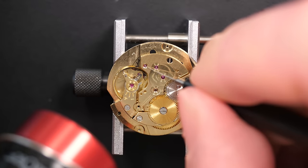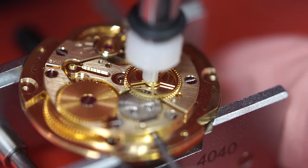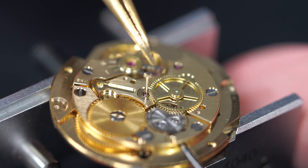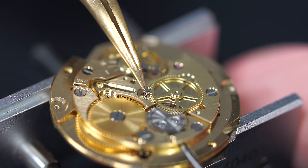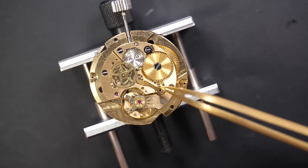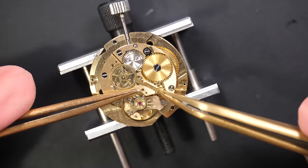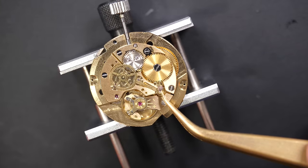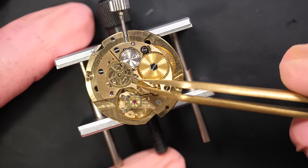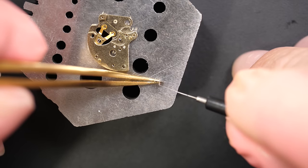Oiling all the jewels on the other side as well — perfect. Now putting the wheel on top that drives the second pinion — it's just a press fit, so using my hand-setting tool to press it in place. Putting this long pinion with a bit of lubrication, and there's a friction spring here which creates a bit of friction in the second pinion to make sure the second hand stays smooth when advancing — it doesn't jump around, it stays as smooth as possible. Now it's in position.